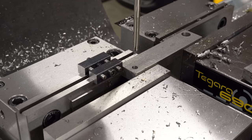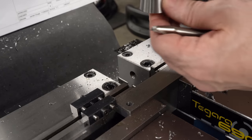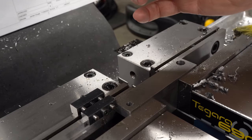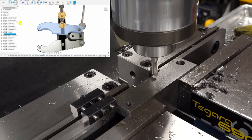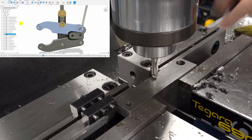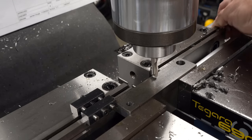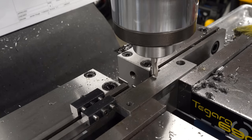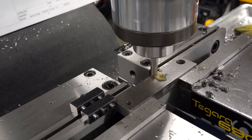Now let's get set up to bore the hole in the top edge. The last feature to mill in this arm is a 5/8 inch hole for the trunnion, and we're going to start making that hole by plunging out material with two-flute end mills. Because this hole overlaps the edge of the part, I'll knock the parallel out using an aluminum rod - it was in tight because I hammered the part down, but now it's just in the way. We'll start with a 3/8 inch two-flute end mill, plunging down with the quill locked and going in with the knee.